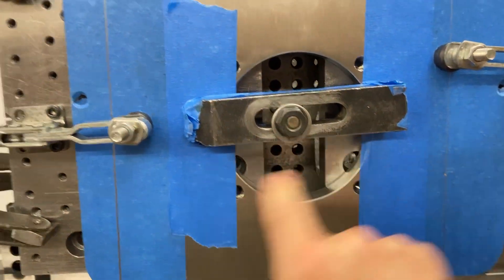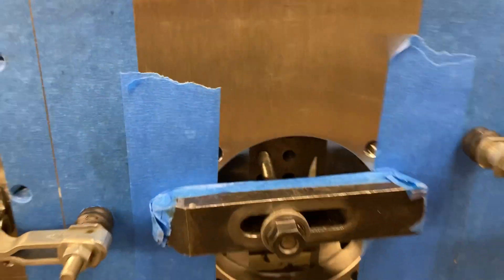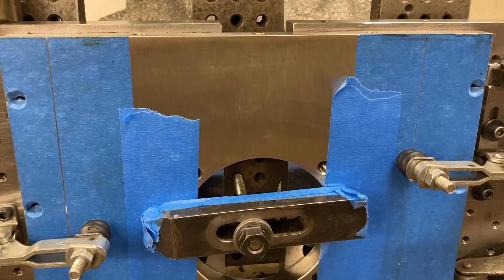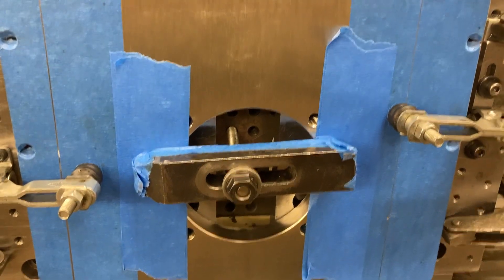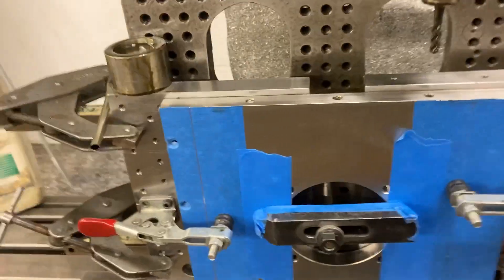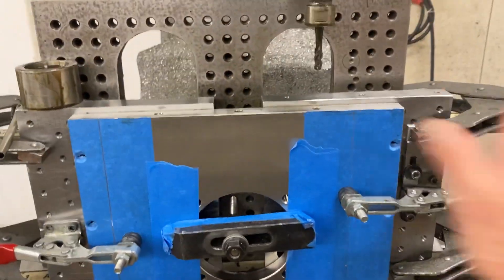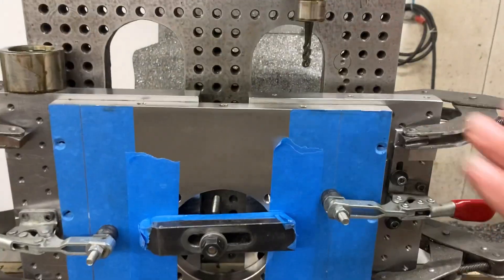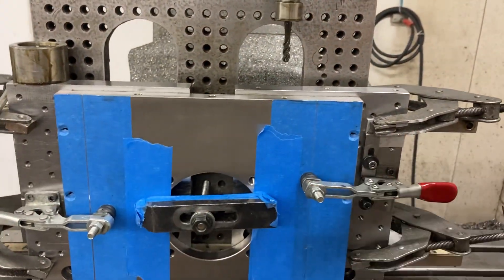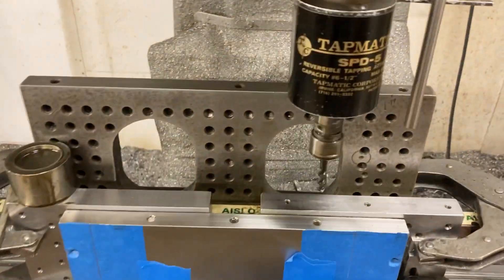I mask these things off to not scratch them. I've got masking tape on the clamp as well — the tape's about 5 thousandths thick, so I put a couple layers on there. It softens the compression so we don't put any marks in it. Same thing with the back side of these plates — I mask them all off so when they bank up against the clean surface I make sure it's clean, no chips. Feel it nice and smooth, put the plate in, bump it against the stop, Destaco them in, put this on, lock it up, and then I'm ready to tap my holes.